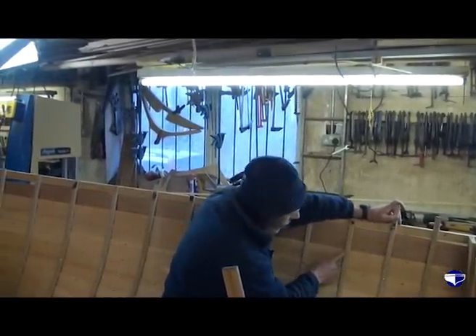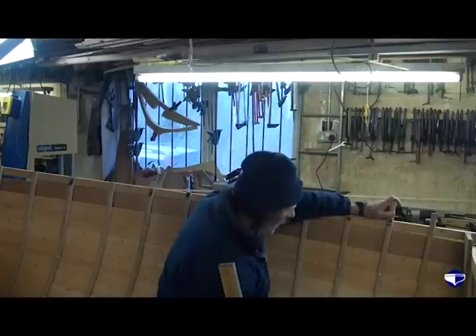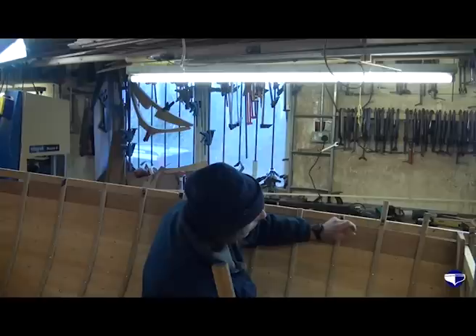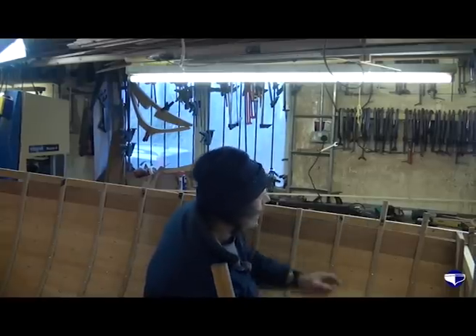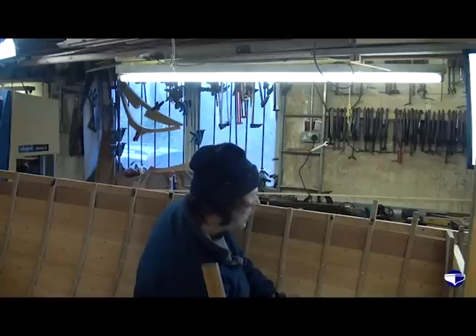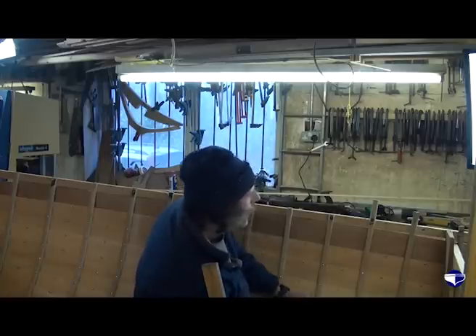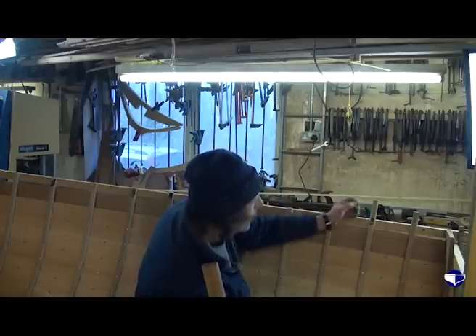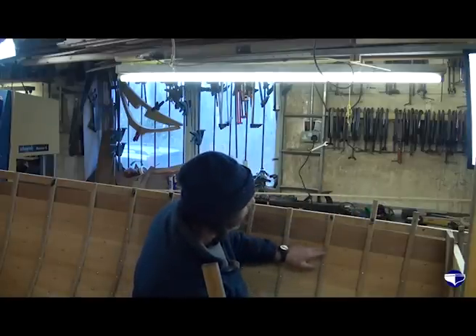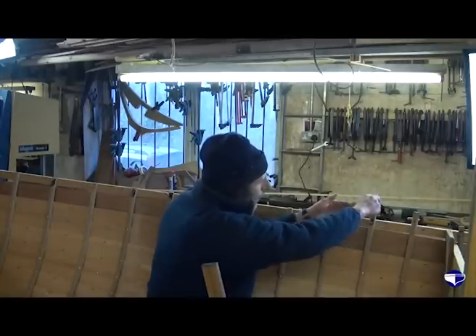You may be wondering why we're not putting a rivet in this top plank here — we will be soon. The way I build the boats, I fit a little four or five millimetre thick strip of timber in behind the ribs, the depth of the gunnel, just to pack out the rib and to help stop the top plank splitting when the gunnel nails are put through. If the ribs are nailed here it makes it difficult to prise them off to put this strip in place later. So by just leaving the top nail undone, I can always drive a little wedge in there to lift that off the top plank and get my little sliver of timber down.